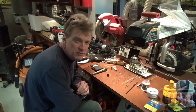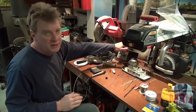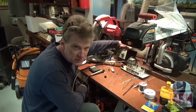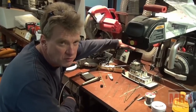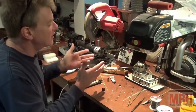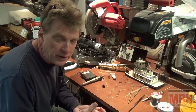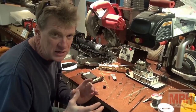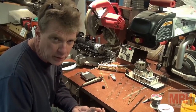So now in this segment of the video, we're going to discuss the resistance soldering rig. I've got a PBL rig here that I've had for about 15 years, and these things work great. If you can find one of these online used, they don't break. They work forever. And the purpose of a device like this is to heat up the location of a brass model or a piece of brass you're working with immediately, so you've got instant heat so that all the surrounding parts don't come apart and come desoldered when you're working on a project.